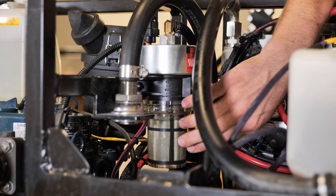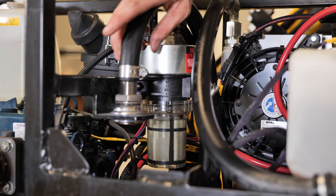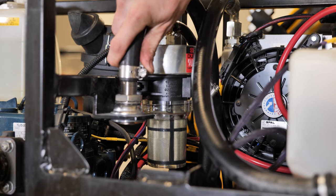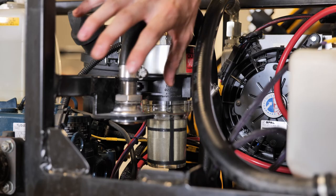Going back to the fuel vent — if you ever have problems filling up your boat with diesel fuel, be sure to come over and check your vent, which is located right next to your electronic fuel pump. This is the tail end of the vent where you see the rubber hose connected to it. On the front side, there's a small lip going around it in a full circle. If you're having an issue filling, who knows — you could have a bee's nest up there. Just take a small metal screwdriver or pick and clean out around the inside of it. That'll pull right out and your vent should open up so you can fill your boat with no problems.